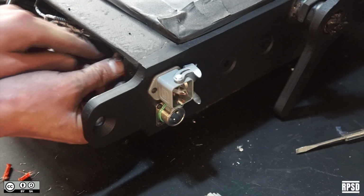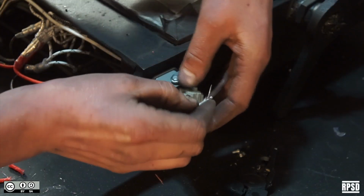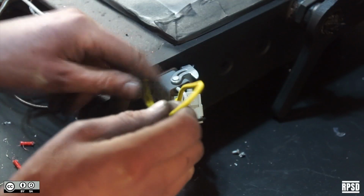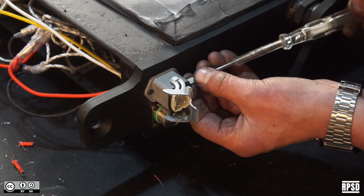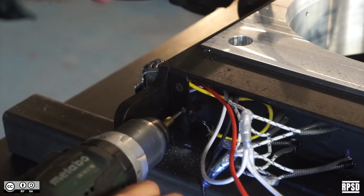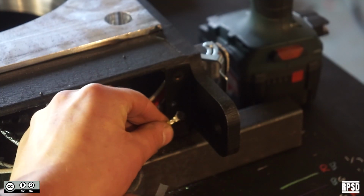Remove the hub for the cartridge heaters and then connect the 3 phase cables plus 1 ground cable and then reinstall the hub. To attach the ground, drill and tap a hole in the bodywork mounting tab closest to the hub, and then using a ground spade, bolt it in place.